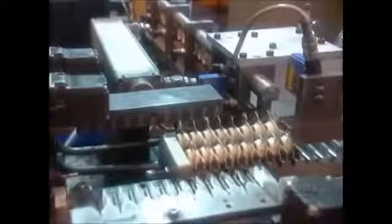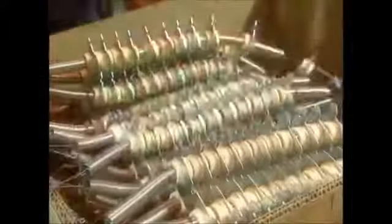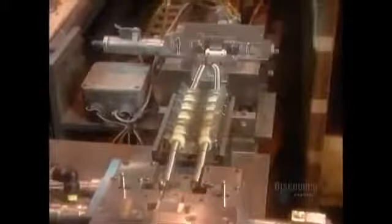The dryer's heating element works much like the element in a toaster, except it consumes a lot more power, up to 6,000 watts. The factory receives the steel and ceramic heating coils ready-made. Workers simply position them on a sheet of galvanized steel. They also install a temperature sensor that shuts off power should something go wrong and cause the dryer to overheat.